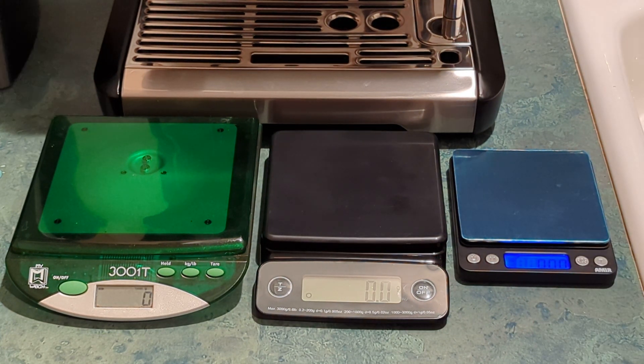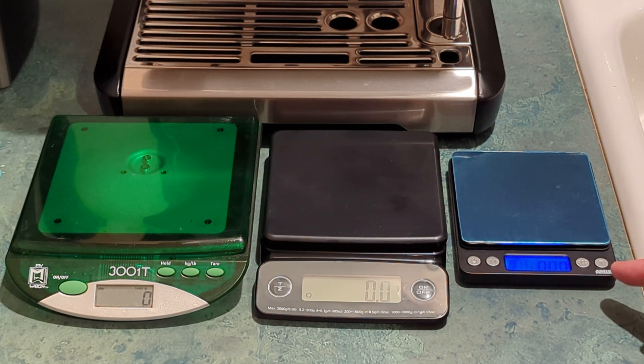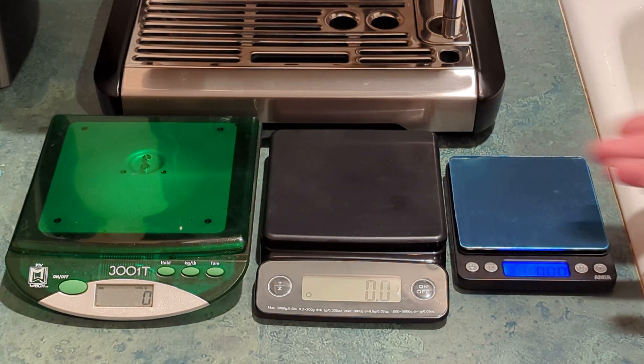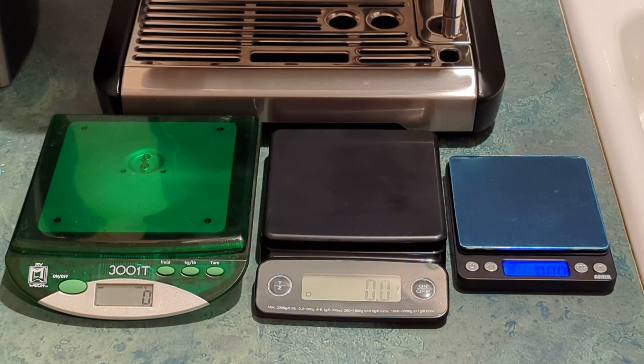You can find these on Amazon — I'll put a link in the description. But what I'd suggest is going to Amazon: if you find it cheaper under a different brand name, it's likely the same manufacturer as long as it looks like this, it's a 500 gram scale measuring in 0.001 gram increments, and doesn't have horrible reviews. Another nice thing is you can easily calibrate it with a calibration weight, and it has hidden features — like holding down the M button and hitting the power button five times to get a menu of different timeout options. The default timeout is three minutes, which is pretty generous.